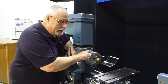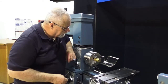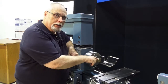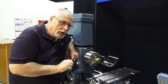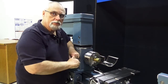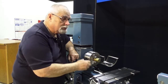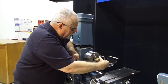Now that we have the jaws back into the chuck, you'll notice I've installed a little piece of material in here and I'll snug it down a little bit. Put your dial indicator on the bed, bring it up here, and rotate your chuck — because just like the chuck mount, there are three different positions you could have had these jaws in. Check each one of those positions; put your dial indicator on, rotate it, and see what the runout is.